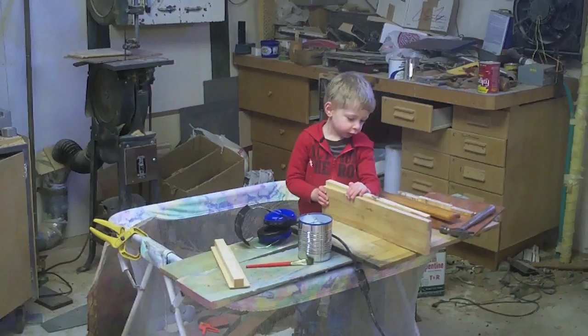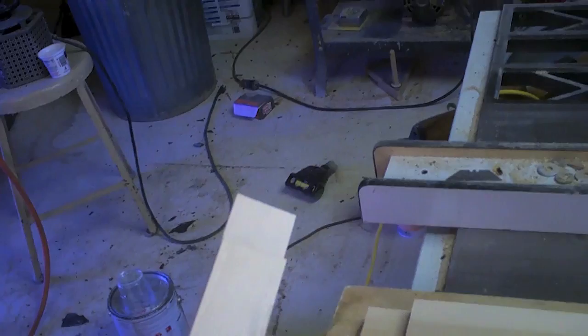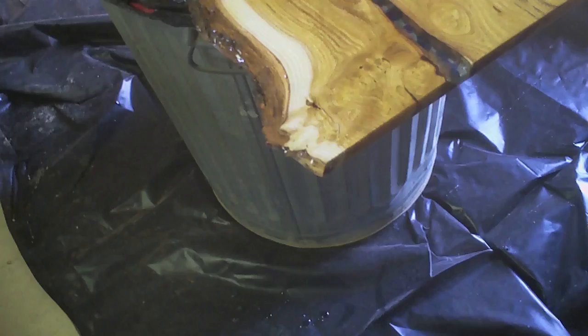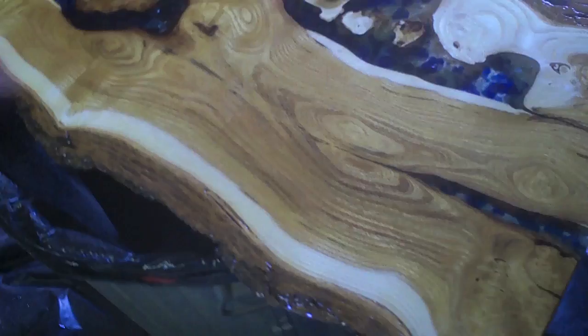Here is the frame — it's simply some rabbit joints. I'm going to use metal standoffs, essentially L-bolts or concrete bolts, so this board will actually hover up slightly. The top side has been ground flat and my goal is to keep the bark on, so the epoxy soaks into the bark and turns it from something soft and spongy to something hard and rigid.